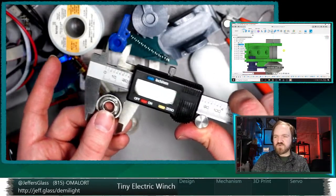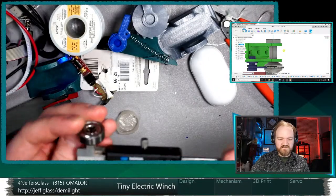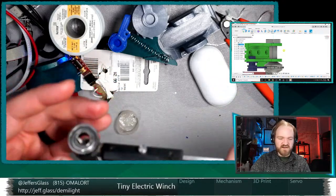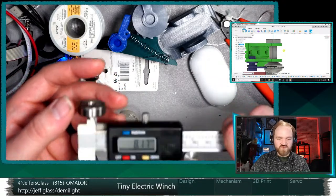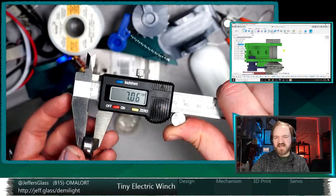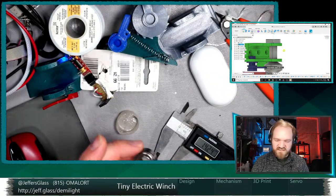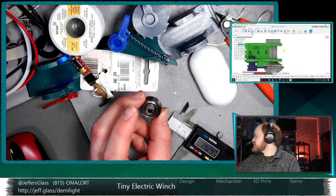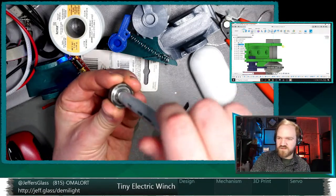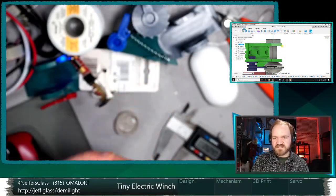So this is a 22 millimeter outer diameter bearing by what I'm going to guess is an 8 millimeter inner diameter, because of course the two points of those calipers are not directly opposite each other. 22 by 8 by 7 is going to be our dimensions here. Actually, before I design these, because I've had them a couple years, let me shove something in there and make sure these still turn freely. Yeah, that's pretty good. Maybe you can see that there, but that seems pretty decent.